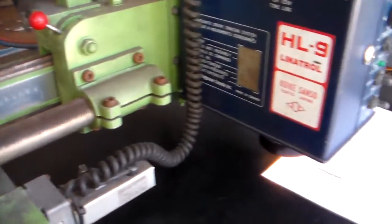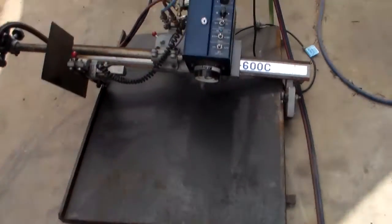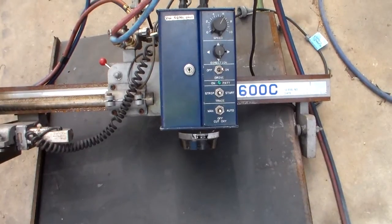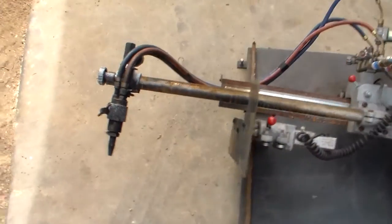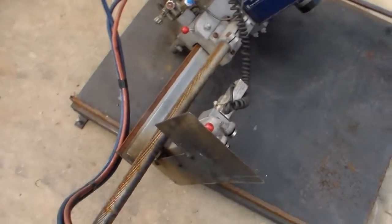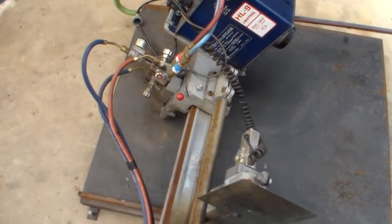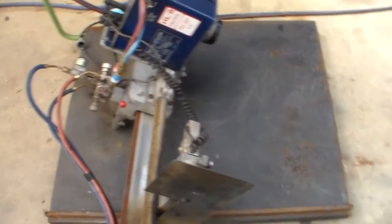I'll get to the bottom of this — I will, I'll fix it. I've also got its brother over here, but I can't get that scanning head to lock on at all. The mirror inside is not very reflective anymore, so that one's a spare parts unit now. Something in the electronics is bad because it won't drive the X motor, only the Y. So that one I'm going to forget about — it's going back to auction or spare parts.